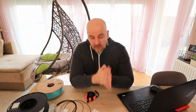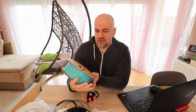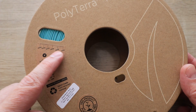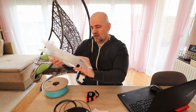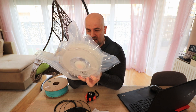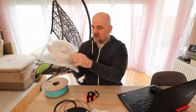There are other methods too. For a smaller project like printing a Benchy — which needs approximately 5 meters of filament — you might not need precision. About 50% of spool manufacturers include a visible scale through the hole in the spool. I can see here I have 800 grams on this spool, which is definitely enough for a Benchy. On another spool there are two scales: one in grams and one in meters, showing approximately 210 meters remaining. This scale isn't super accurate but works well when there's a big difference between what you have and what you need.